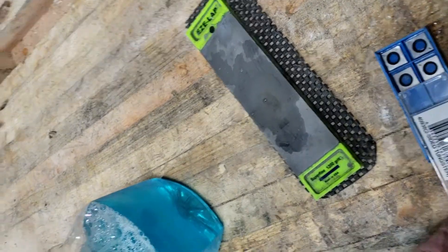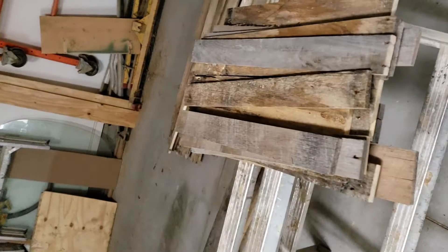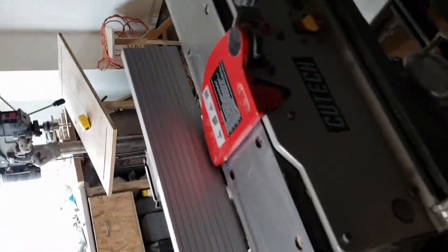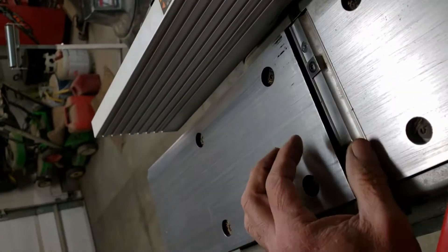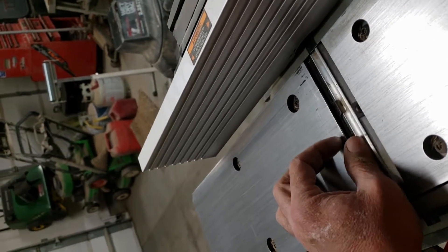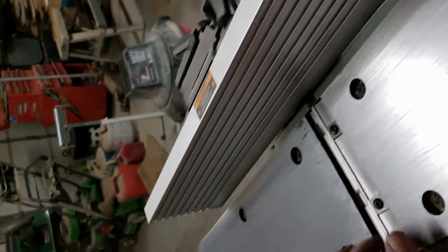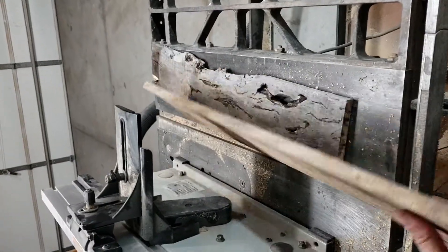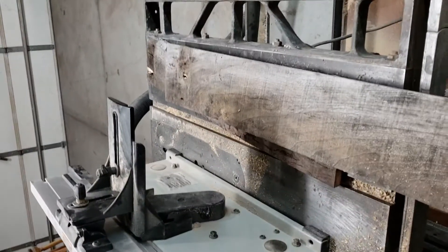Right now I'm making a tabletop. I've already planed this amount of wood and I've got that much to go, so this thing has been running pretty flawlessly. These are the carbide inserts, and I'd say right now having sharpened these — you have two sides — I have easily upwards of 5,000 board feet across here, enough to fill up this can about four times. Here's some of the wood I'm using. I'm getting better at figuring out nice cuts for a tabletop.